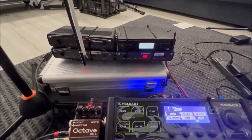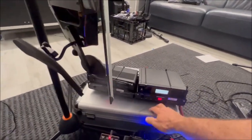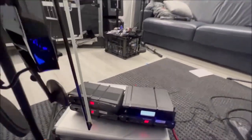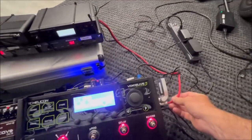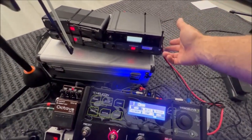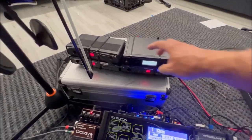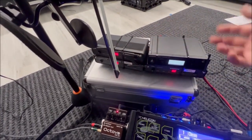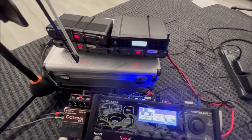This is the guitar wireless. This whole unit I call 'the football' — it travels in this box and sits up above so I can adjust levels if needed. All I do is pull it out of the box and plug the vocal in here and the guitar in there. I went with quarter inch because it was easier — the wireless setups all have quarter-inch out. I sum the two vocals — they're the exact same unit with the same output impedance — running them with a Y into this connector. It works great and saves me from having another mixing board in here.